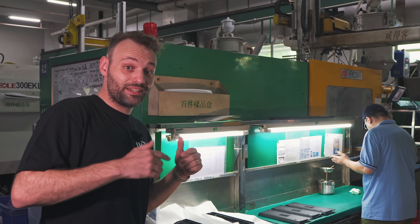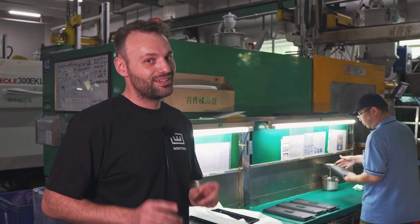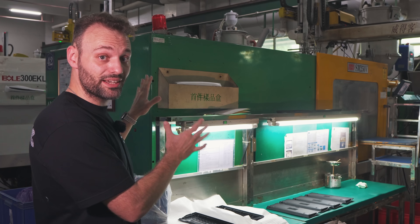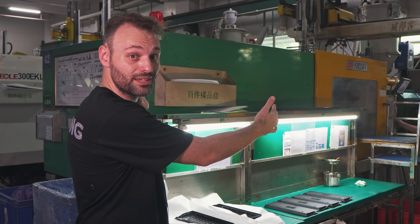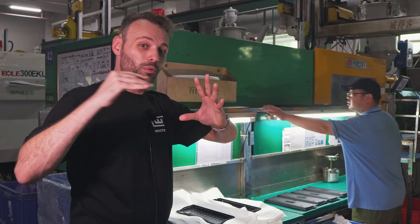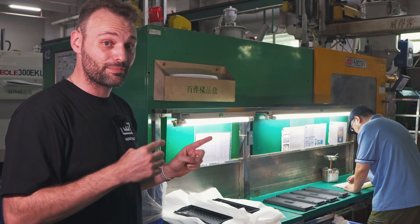Let's get started first with the injection machine, which is the very start of your ATHC. Here we are at the injection machine. It's very loud in this whole space. So here we have a plastic injection machine — it's a huge machine because these two molds have to come together and be pressed really hard while injecting plastic. Let me show you how it works for the bottom case.